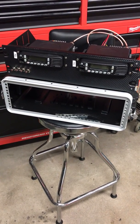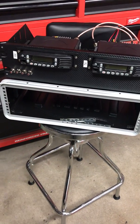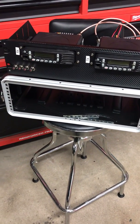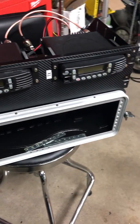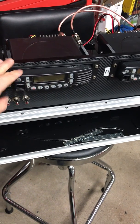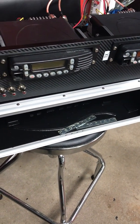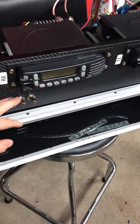What you're looking at here is a GMRS radio repeater, sitting on top of its case right now. I built it using two Kenwood TK 8180 radios. I took a 3U plate, cut open some slots for the radios, some holes for the switches to turn the radios on and off, turn the fans on and off, and also the repeater controller on and off.